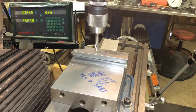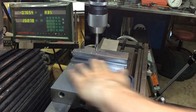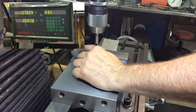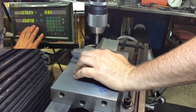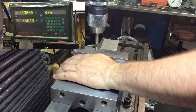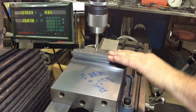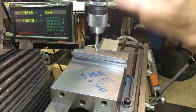I've got the three grooves milled in them. I got this one set up and I'm going to start to drill. What I'm doing here is spot drilling these, and I'm saving these points so that I can just put in the next one and go to those points in memory and drill.